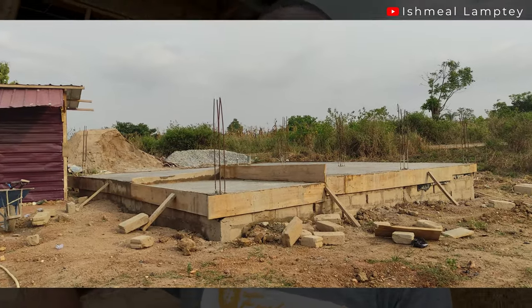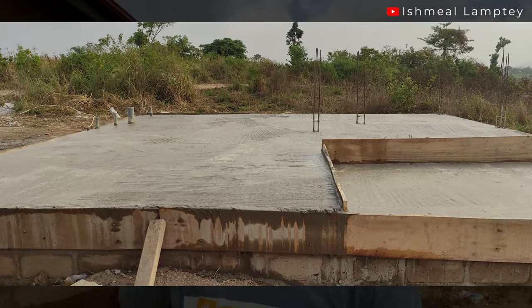After that, we also bought one trip of laterite or gravel to do the fill. We got some of the surrounding soil but it wasn't enough, so we had to purchase that as well to fill it entirely. We soaked water on it so it could sink properly before going ahead to cast the concrete on top. That whole process didn't take more than a week. You'll also notice that the porch section goes one step down compared to the rest of the building — it's not on the same level.